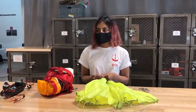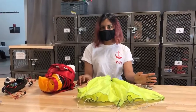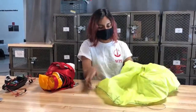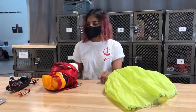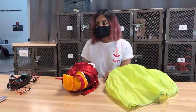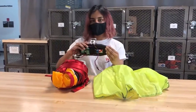I'm Nikita. I'm in charge of the recovery sub-team this year. Recovery is in charge of making sure the rocket lands safely. This year's rocket has a total of three parachutes. This one is the drogue. When the parachute opens, the air goes into the pocket right here, creating a drag force. Since the rocket is falling down from really high up and it's really heavy, we need another parachute to slow it down. Right here we have our main parachute, which is 12 feet wide — it creates more drag, so it slows down the rocket faster than the smaller drogue parachute. In order to get the parachutes out of the rocket, we also have electronics that push the parachutes out at the right height.